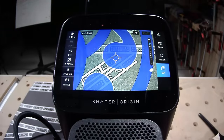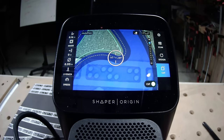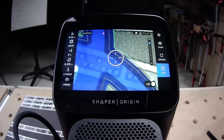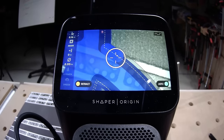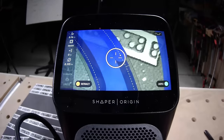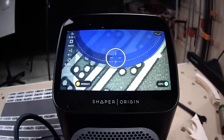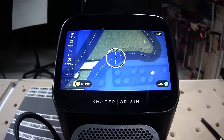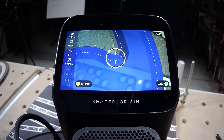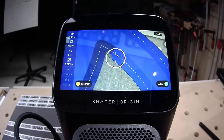To change that cut type, you're just going to click on that cut type menu button and switch that from pocket to inside. And now Jake's going to follow around the uncut portions of this horseshoe. And you can see where he's already done the inside cut on the rest of the horseshoe, or scroll, if you will. This one has some left to be cut on the inside, but the other two he did in advance. A little cooking show magic.